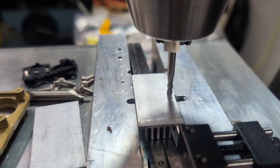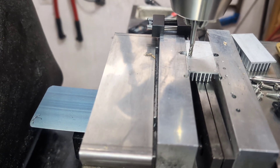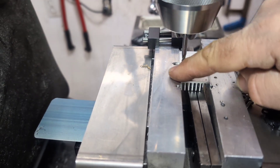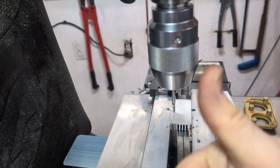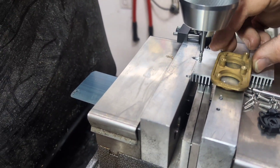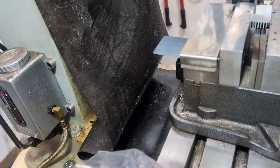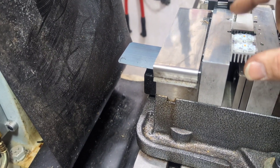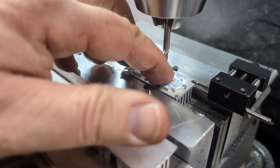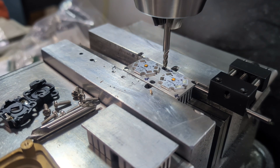We've got a little bit of a gap there on the outside, so that'll be good. We're going to do this with an end mill right here. I've just got to set the y-axis. The x-axis is this way, y-axis this way, z is up and down. I need to make sure I've got my distance right so that it fits. I'm checking it with this piece here which has already been confirmed to be a good part. It will come out right. When you set your toolpath, make it repeatable.